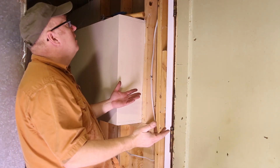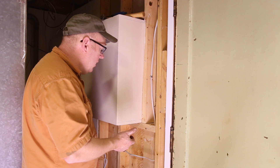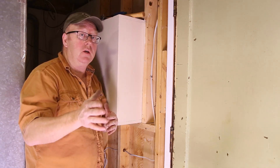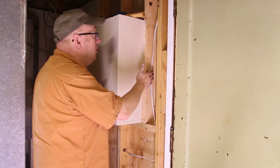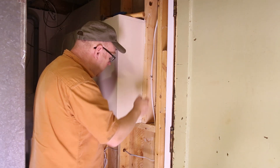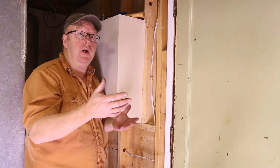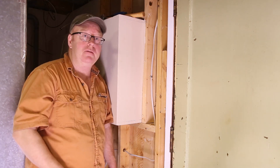So that's all there was to it — to do it right. Put a junction box up, add another piece of wire, and it's about 45 minutes worth of work and you're done. Now if you're not comfortable with wiring, make sure you talk to a professional or read up on it. Go through your code book — find out how far apart your staples have to be, how much wire has to stick out of your box, all those little rules. You need to know them. If you're doing stuff yourself, take some pride. Do it right so the next guy doesn't call you a schmuck. Until next time, thanks for watching, stay tuned.